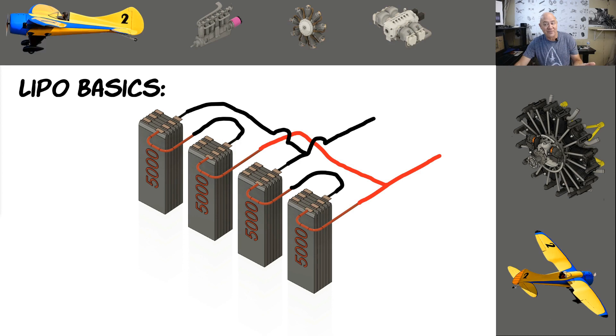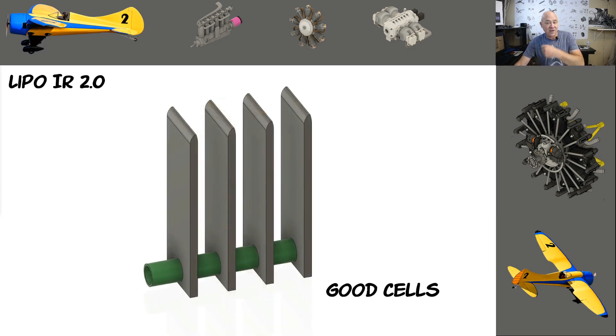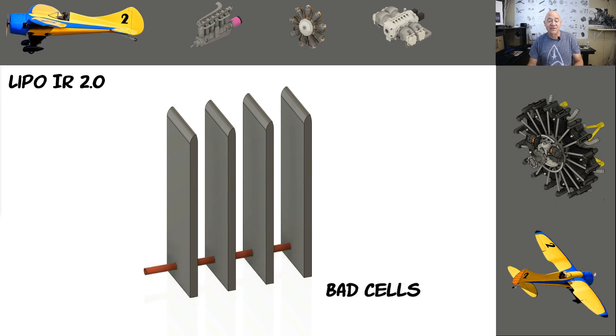For illustration, imagine the cells are liquid vessels filled with water. That big green tube is your internal resistance — the bigger the tube, the lower the internal resistance, and the more easily it pulls liquid out of those batteries with less friction. High internal resistance means a tiny tube you can barely get anything through. If one or two cells go bad in the pack, your voltage may check out fine but internal resistance will reveal the problem. If you feel a hot stripe while charging, or one cell runs super hot after a flight, that's a bad cell.